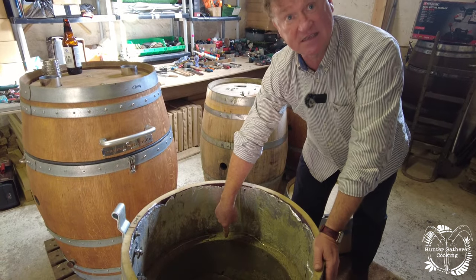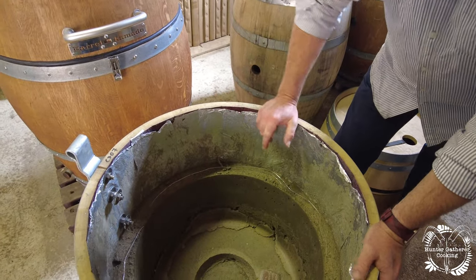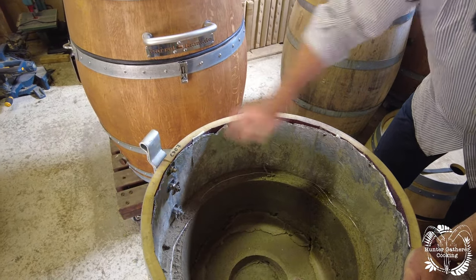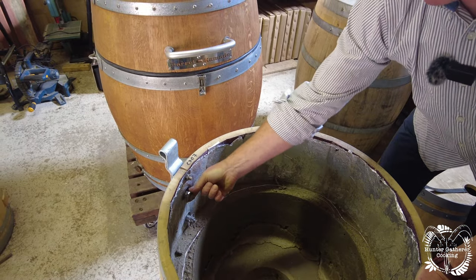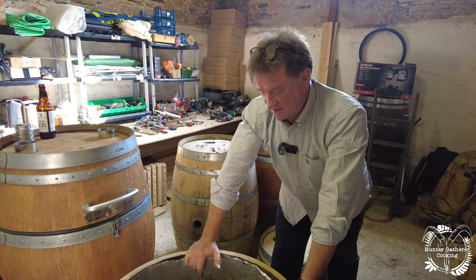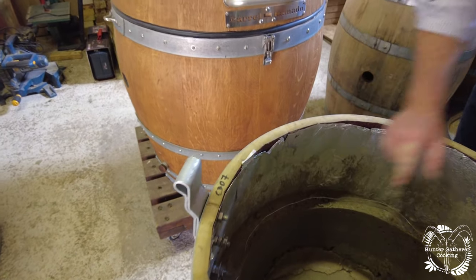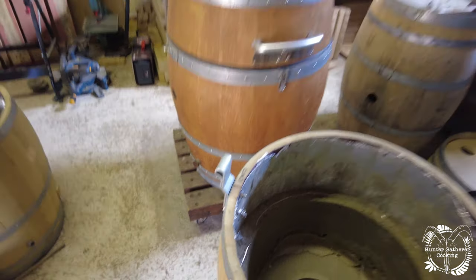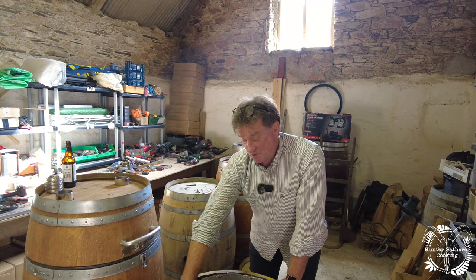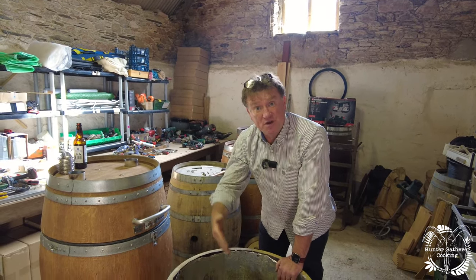We reinforce the refractory with stainless steel rebar — a very fine mesh stainless steel — and we also use stainless steel M10 nuts and washers to secure the hinge, which is then impregnated into the cast. Each barrel comes with a serial number and a four-digit code, and we photograph each stage of the build so that when the customer gets their barrel, they can connect to the website and see all the stages through to a complete Barrel Kamado.